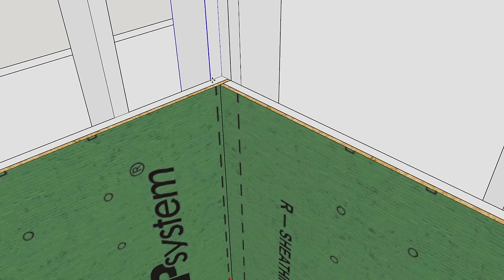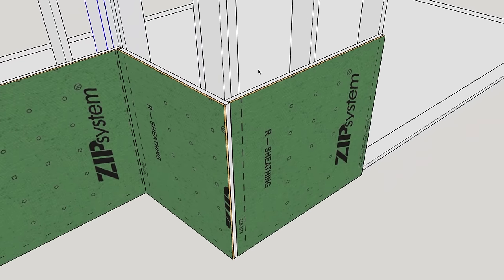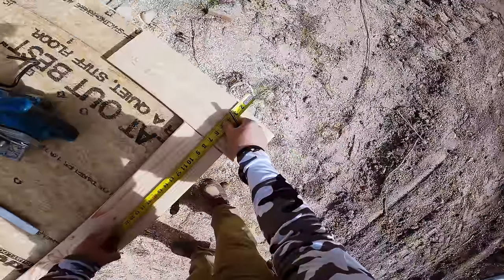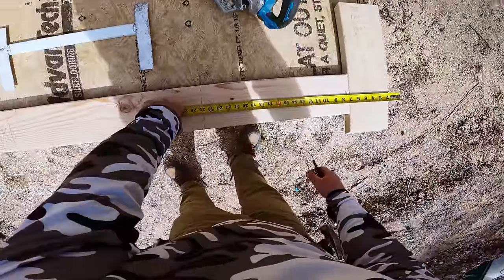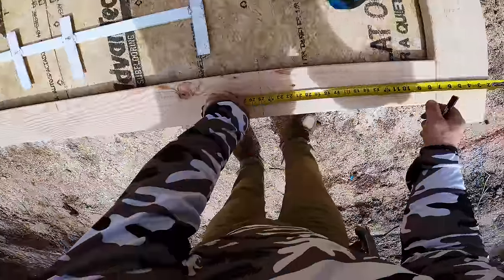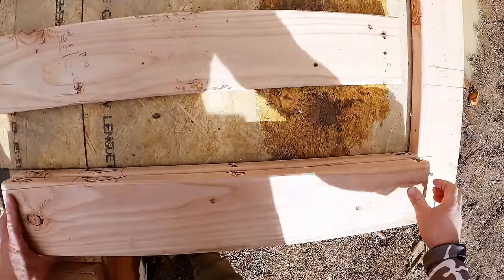If you wanted to, you could add another stud here — like a partition that offsets you enough to have nailing. You can double a stud; when we've done this we just nail up scrap to make good efficient use of our materials. Here's that outside corner again: I'm laying out from the outside of the stud to center, and I want my foam to fully cover this. Now I'm going to show you how we go about taping that. Here in practice, notice what I mean by burning an inch and seven sixteenths — then I find 24 inches is the center, add three quarters to get to the long point of my stud since it's a rake wall.